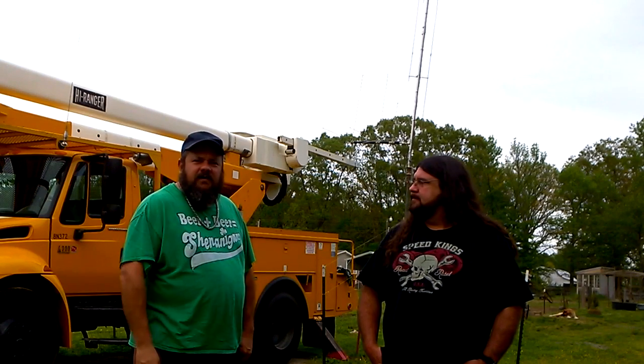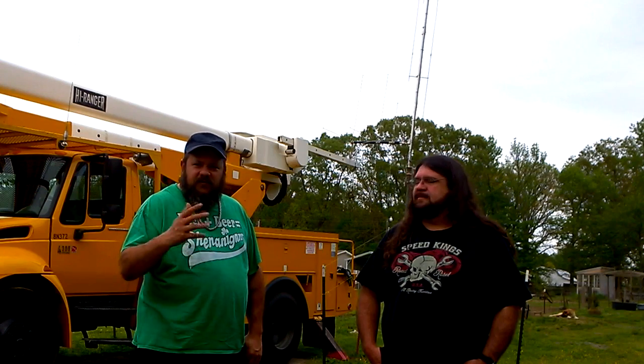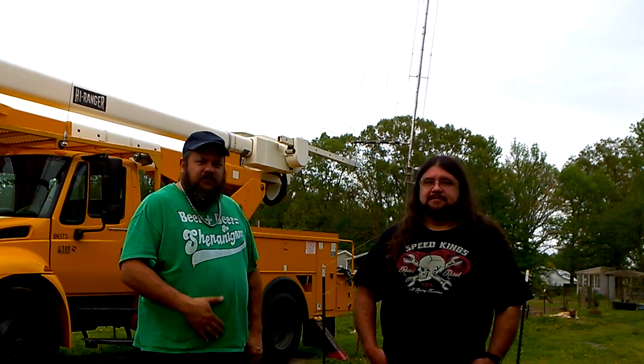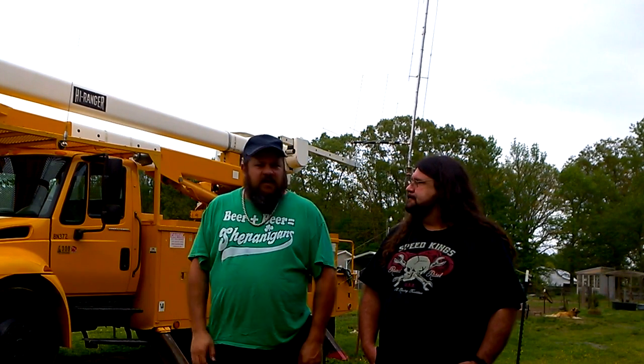All right, we're back here at the antenna. Just want to wrap everything up and say we had a wonderful day, had a lot of good food to eat, good friendship, and got the antenna up in the air, the hex beam. Just made a couple contacts, fantastic signal reports. Gotta love the hex beam. It's a lot of fun. It works well. The SWR is right in the range, 1.9 at the bottom or top of the band, and good in the middle. You can't beat that.